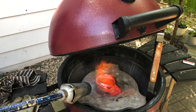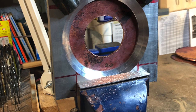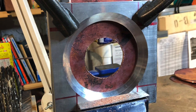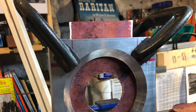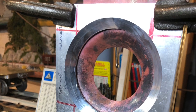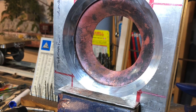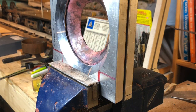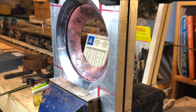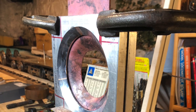I've used far more material than I needed to initially because I was just being ultra cautious - I didn't want to do all the flanging and then find I hadn't sufficient depth on the flange and have to scrap the part. Much easier to have extra and then carefully measure, as the material does stretch as the process goes on. That's me annealing the copper on the old barbecue, which worked out pretty well. The propane torch was a bit of overkill but certainly very effective in heating the plate and annealing. I must have annealed probably maybe 10 or 12 times all up.